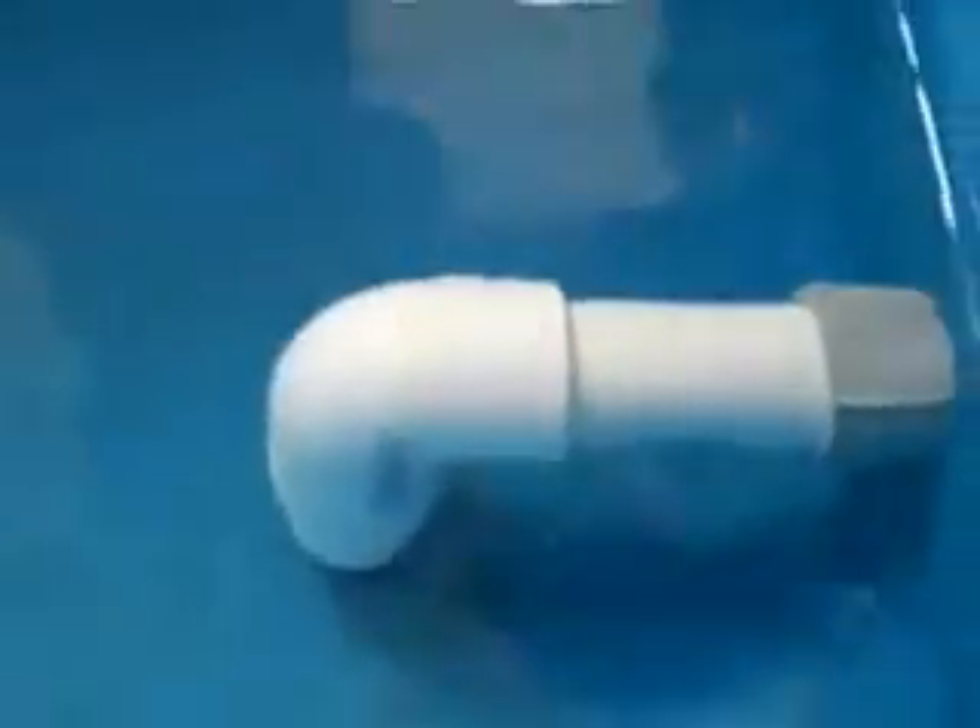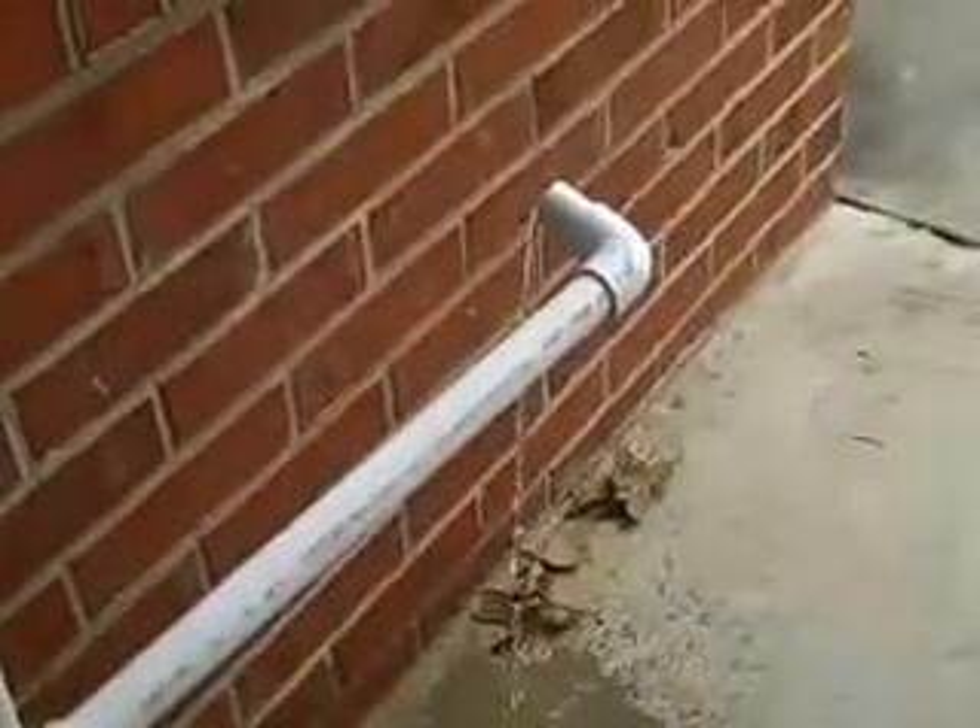You can see how I've got it connected. I took the pipe down to where it's almost touching the bottom — when it starts to siphon it will suck water all the way down until it hits the bottom and then break the siphon. It will not fill up all the way because I didn't have the stand pipe all the way up. It is a brisk 35 degrees right now outside in North Georgia, so I want to get this done and get back inside. Okay, there you go — the water begins to flow out of there.